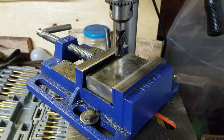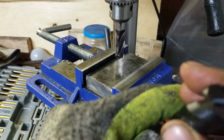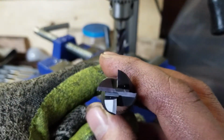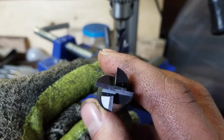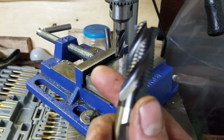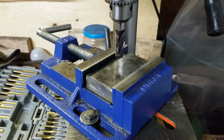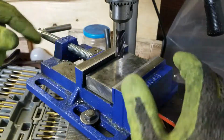All right, so I have never used one of these before. I've done a little bit of research, and I know those other crappy end mills, you couldn't plunge mill with them. But these ones look like a split flute design, so I think you can plunge mill with these. This is a big 3/4 one I was going to use for hogging out big stuff, which we'll get to at a later date. So I bolted this down. I put one bolt, and the rest of it's resting against the back of the unit.